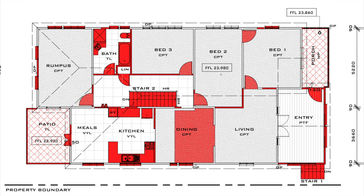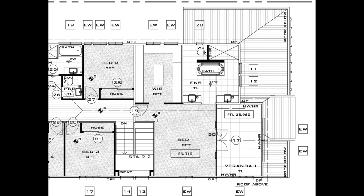This is a demolition floor plan which might help to explain. We're looking at these three rooms at the front — the living which becomes the master, bedroom 1 which becomes the en suite, and bedroom 2 which becomes the walk-in robe. We demolished all of the doors and windows and removed this dogleg section of wall to increase the size of the master bedroom and create an entry. On the new plans, the dogleg is gone, the master bedroom is bigger, and there's the entrance.